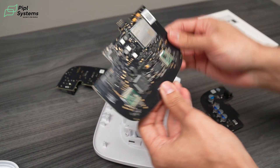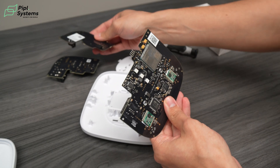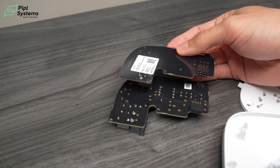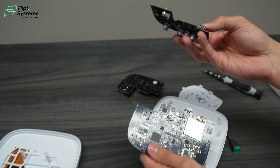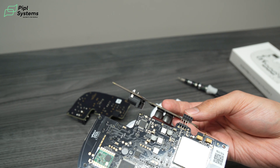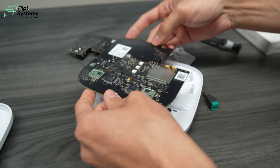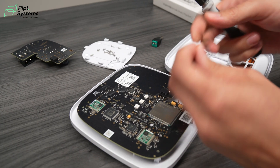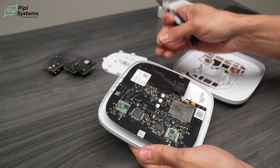Put the silver part here. We have the bridge here, and now we need to connect our power supply — exactly like the one you had before. You have the bridge that you will need to connect here — you can compare them — and then we will connect it to the hub. It's the lower one. You have two types of parts: up and down. To be on the right side, you need the lower row. Insert the bridge and push. Now re-screw all nine screws. Your screws are inside the smart bracket so you don't lose them.